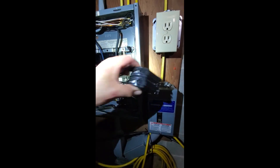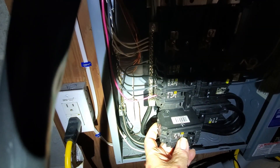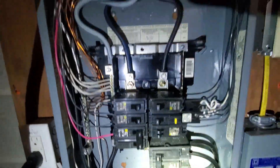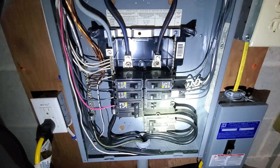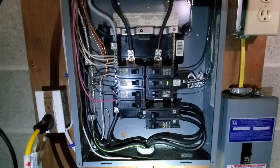I've got some complications here. I was hoping to put the 50-amp breaker right here, but that stud right there — the neutral thing sticks out so much. It's just not going to work. This thing is hitting that stud, and I think all of these are going to hit that stud. So what's the purpose of these bottom two things? They're useless. That's a bit irritating. I'm going to try to move this top one down here, maybe in the last one, and then move this one over up there. Hopefully I've got enough wire so that I can get two spaces over and be able to put it in here. Otherwise it's not going to work — I'm not going to even have space on this panel.